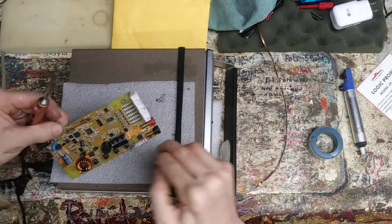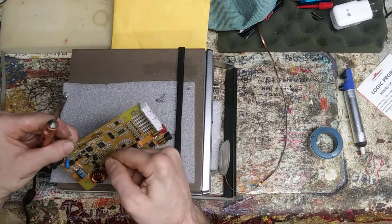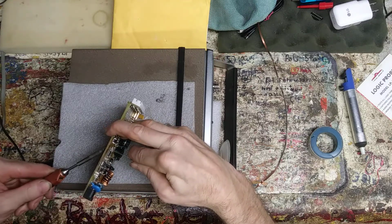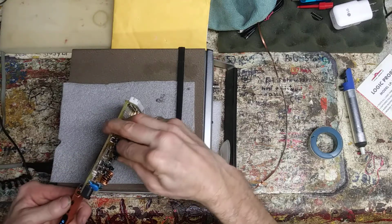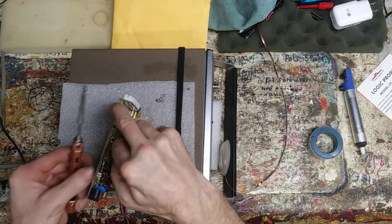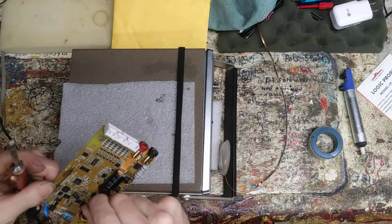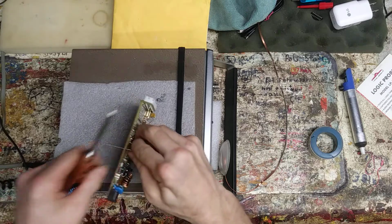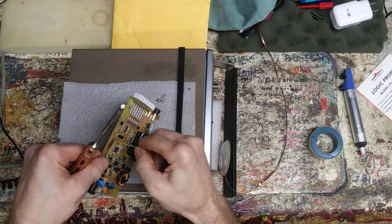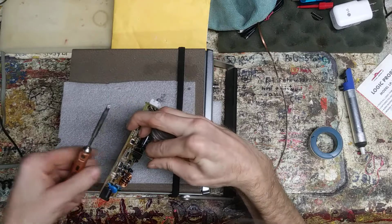Yeah, I'll tell you, they come in handy, just having a set of little pins and stuff like that on hand. I'm always using them for something. And on top of it, knowing how tight them pins were coming out, you really don't ever want to go through and drill or do anything crazy like that on something like this, because you'll end up ripping out the whole copper rivet trace and everything that's down through it. That one was open.